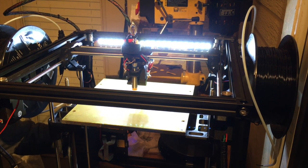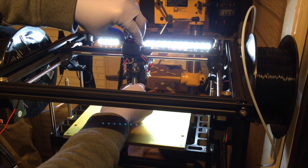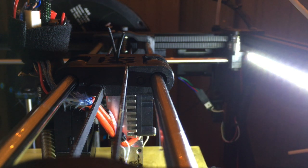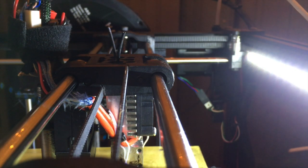The Trinamic drivers are really nice, but they require a lot of cooling. Like a lot of cooling. I have the E3D fan actually controlled, and I know it's not recommended usually, but I really can't have it on all the time because that just drives me nuts. The LED strip is actually in line with the controller fan that's on the RAMPS box. So whenever the controller fan is going, the LEDs are on. So when the print is done, 60 seconds after the motors get disengaged, the lights come off and everything just kind of shuts down slowly.